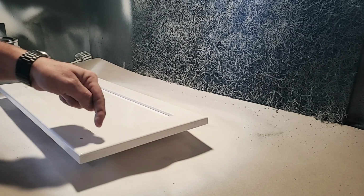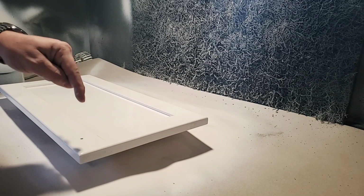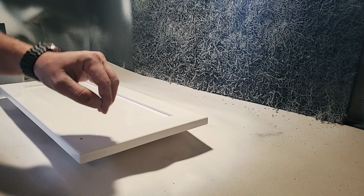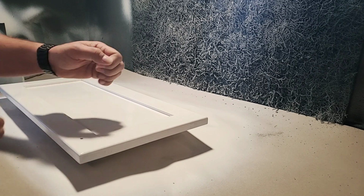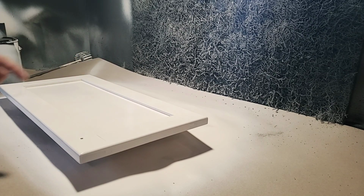You are going to see the natural joints in the actual finish. You can get away with this depending on how they mortise in the joints, how it was put together and glued, to minimize that. I don't like using spackle over this because simply they start to pull apart, crack, and fail. We don't caulk the panel joints because it causes issues.